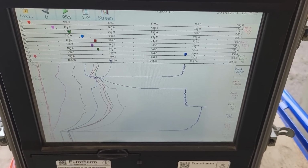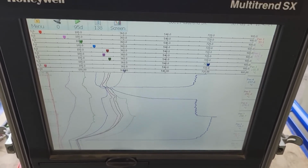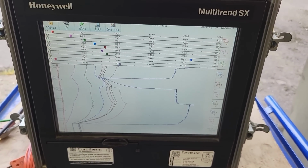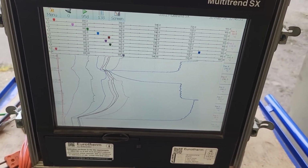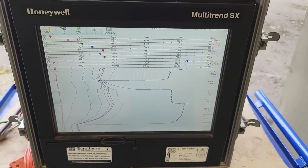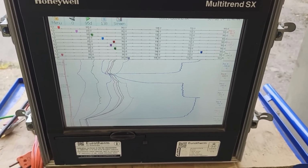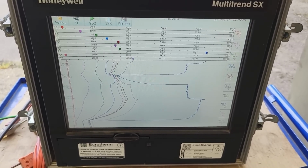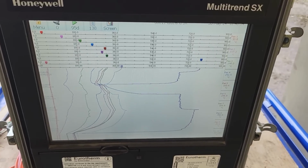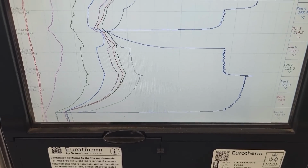Right, and that's the bubbler just going on, so we'll see what the exhaust temperature does. Yeah, going up a bit. Straight away when Malcolm opened the bubbler feed, that exhaust temperature's come up again. Is that bubbler running a little bit more than it was before? Because that temperature... a little bit more.